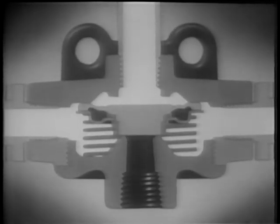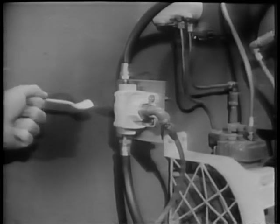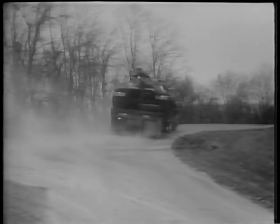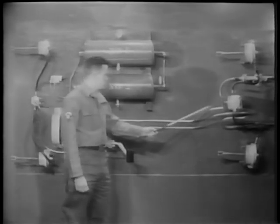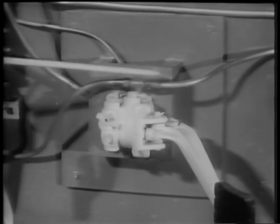When the brake valve is released, there is no pressure above the diaphragm, so the spring is able to return the diaphragm to its seat. This blocks off the passage back to the brake valve, but opens up a shortcut that leads directly to the outside. The air in the brake chambers escapes quickly without traveling the long route through the air lines to the brake valve. On long wheelbase tractor trailers, the front brake chambers are close to the brake valve, while the rear brake chambers are a long distance away. Yet the rear brakes must be applied at the same time as the front brakes and must release as quickly. The relay valve provides quick response for the rear wheels. It provides a direct compressed air feed from the dry reservoir to the relay valve and then to the rear brake chambers. This air feed is regulated through the control airline by the brake valve.